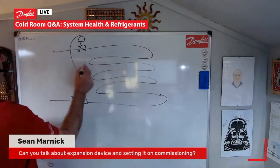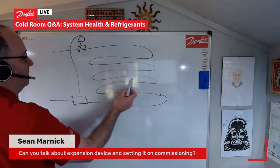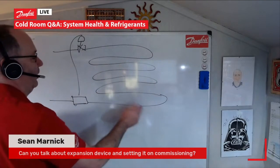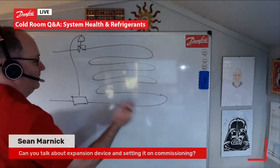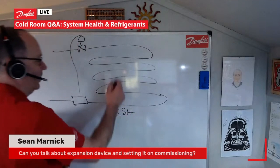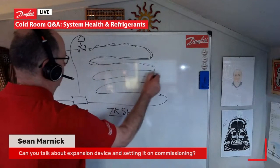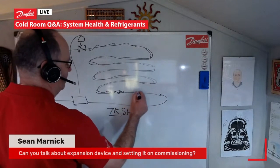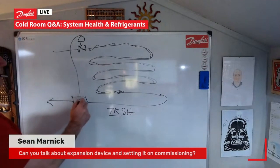The basic idea is that we have our expansion device and we expand that liquid into our evaporator. We want to have a refrigerant liquid-vapor mix in that evaporator as much as we can, so we utilize the whole surface area to get our duty. With a 7K superheat, we'd be utilizing the majority of that evaporator — liquid boiling off all the way down, then a small portion for superheated refrigerant, with vapor coming back down the suction line to our compressor.